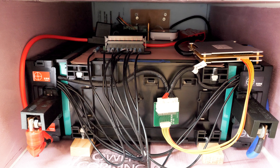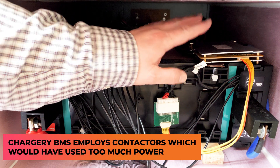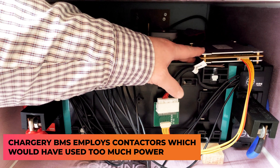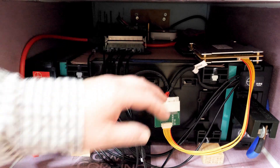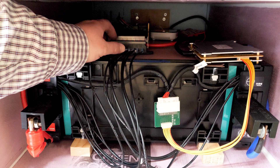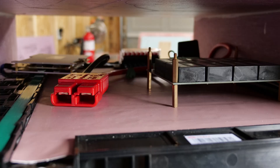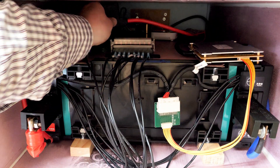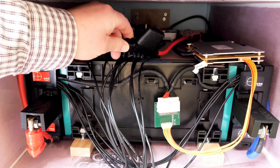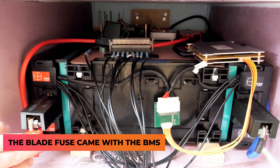Taking a quick look at the inside of the insulated battery box — I have three sets of BYD batteries. I'm using an inline fuse here, Class T 150 amp. Here's the BMS; I switched from Chargery and decided to go with a Tech Direct BMS. They make a special adapter so you can use the internal cabling for the individual cells, and I've also run my own wires to each cell which go through a fuse box. From there it's simply positive and negative out. The BMS just works off the negative. There's also one more inline fuse in here — I don't have a lot of faith in it so I may cut it out, but for now I'm keeping it. So this positive line is actually double-fused: the Class T fuse and a blade fuse.